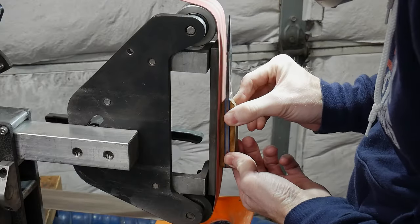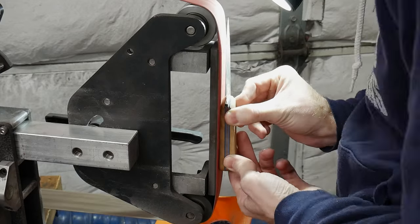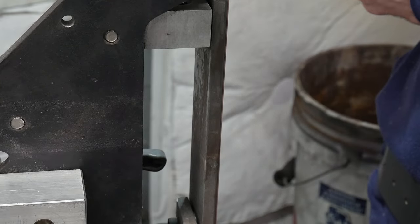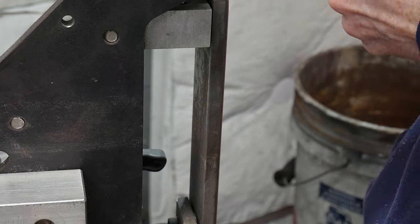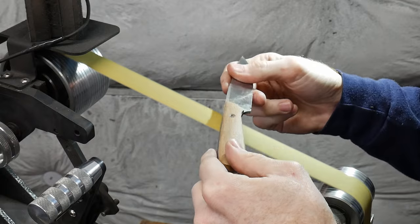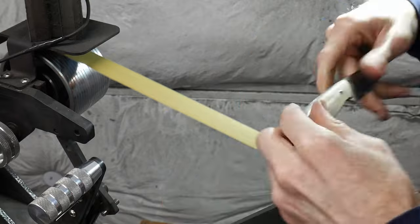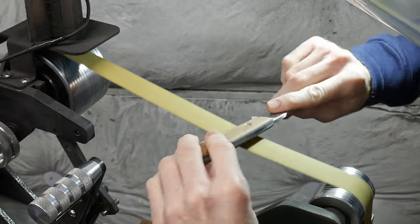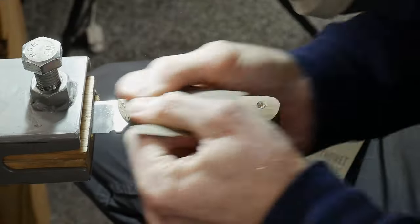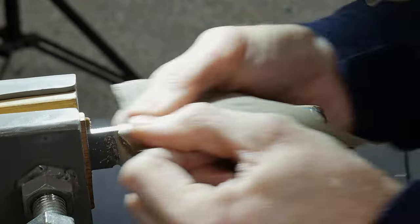I roughen the taper and the basic shape of the handle with a 60 grit ceramic, and then blend everything with a 220 grit scalloped J-Flex belt before heading off to hand sanding. On the hand sanding bench, I work up from 320 to 1000 grit, and then finally buff with white buffing compound.